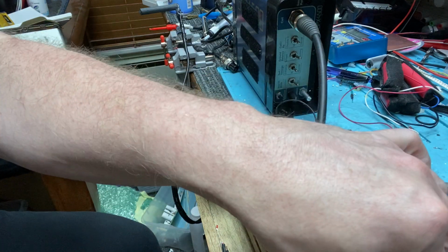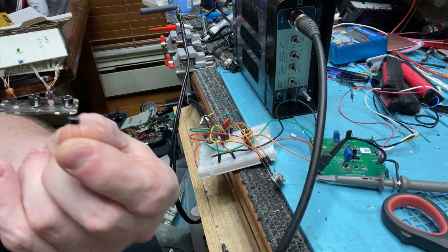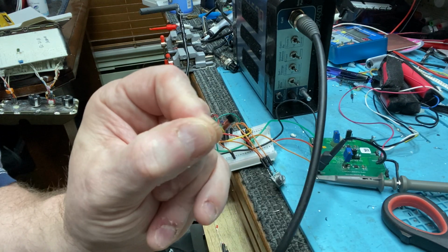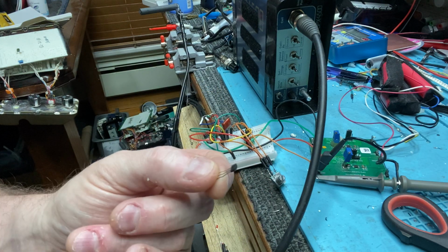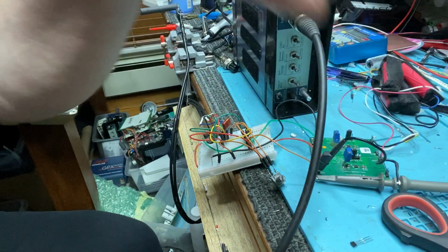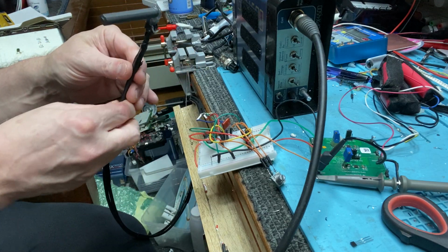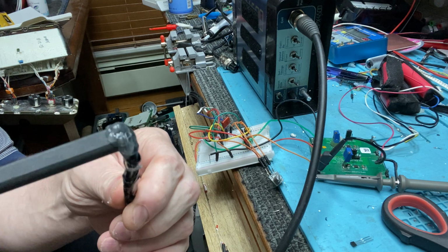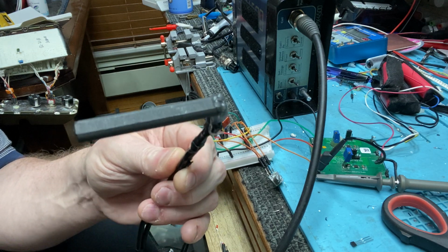Yes, there is. This is a Hall effect device. They're very tiny, as you can see. I'll put on the blue. That's what it is. Looks like a little transistor, but it's got 5 volts, ground and output, and that's all it is. Anyway, I've got one here, and I made up a cable, and I've stuck a bit of ferrite rod with hot melt glue on it, and that acts as a magnetic field line concentrator.